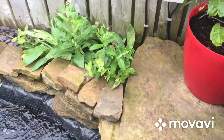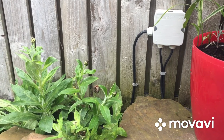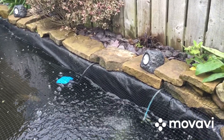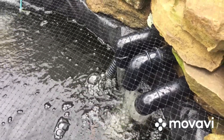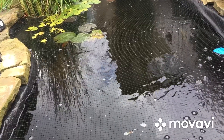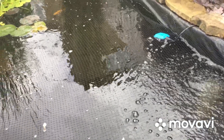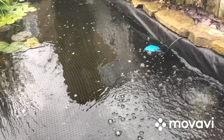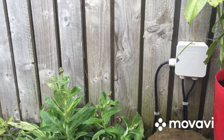Right, here we have it — all installed and fitted, closed up, a couple of cable pins to hold everything in place, nice and tidy, watertight. The cables run down behind there and out through the rocks, laying up to the surface. Now, should that pond drop below about five inches, the pump will shut off and we won't be losing water. We've still got circulation and two oxygenators either side to keep the pond oxygenated, so the fish will still have water and oxygen but won't be subjected to the pond being pumped completely empty. All done, fitted, nice, neat, safe, and watertight. Cheers guys, thanks for watching, see you on the next one.